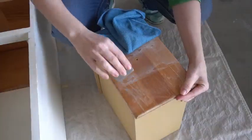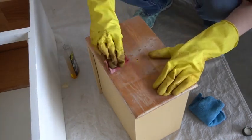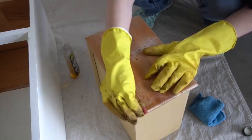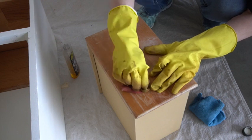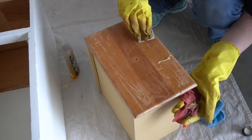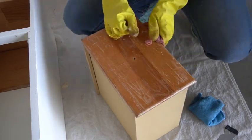The water loosened the glue but not enough, so I pulled out the tough stuff — Goo Gone. I applied it to a scrap rag and wiped it across the entire surface. Goo Gone is awesome because it chews through sticky stuff like this, but it's a solvent-based remover and not a low-VOC product, so I wore my respirator and did this in the garage with all the doors open. The adhesive came up with my Japan scraper no problem. I used soap and water on clean rags to remove all the residue, then did three passes with different rags using less water each time.